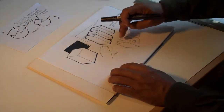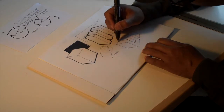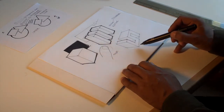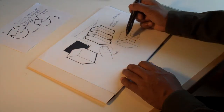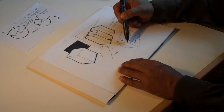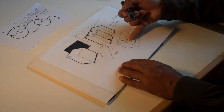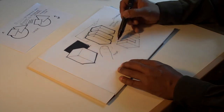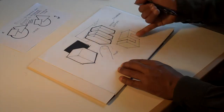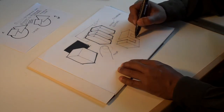I'm going to describe line weight a little bit differently here. There's another way to think of second line weight — in terms of surfaces. I can see that surface, this surface, and that surface. And I can imagine this is part of another surface that's hidden underneath, behind. So whenever you know there's a hidden surface, that is an opportunity to do a second line weight. Let's think about that again — this edge is part of another surface I can't see. If you have an edge that's part of a hidden surface, that is a good place to put a second line weight.